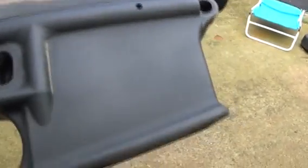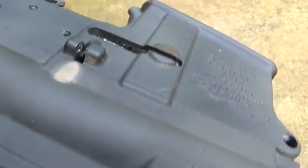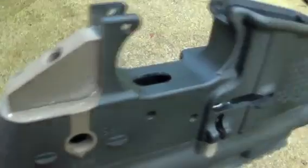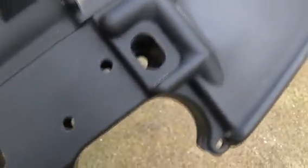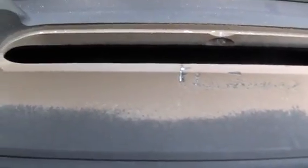It didn't really affect the anodized coating at all, and I'm assuming it would work on something that's been sandblasted and then Cerakoted as well, and it shouldn't affect the aluminum, because the salt just disintegrates. Once it hits it, it disintegrates, and it really doesn't embed into or remove any material except the paint. And that's the Cerakoted Magpul flat dark earth. It was probably a few thousand PSI, maybe 2,000 or 3,000 PSI, it looks like. But yeah, that's how you take it off.